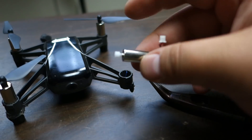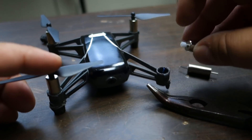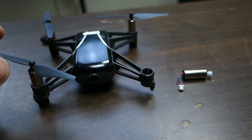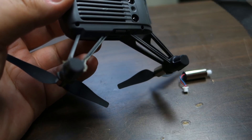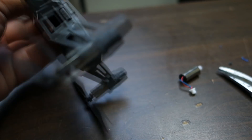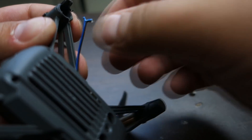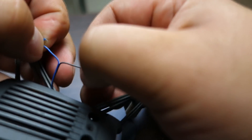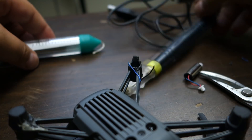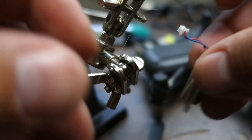Right now I want to use this one — it's the opposite of the one I had in here. So now this is going to work. We start by taking out the cords, which can be a little bit tricky to get out. Remember to take out the battery so you don't short anything. Pull the cords away from each other a little bit. We'll need a soldering iron and a magnifying glass so I can see what I'm doing.